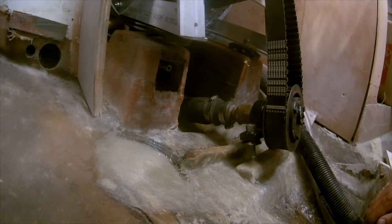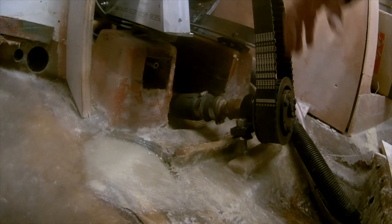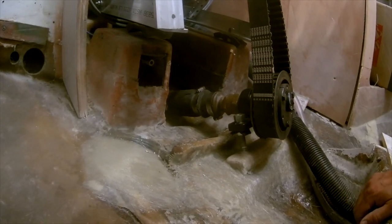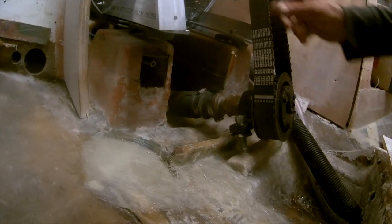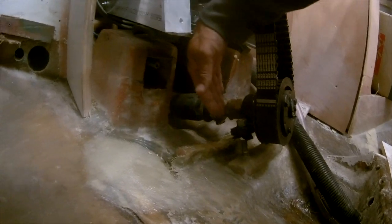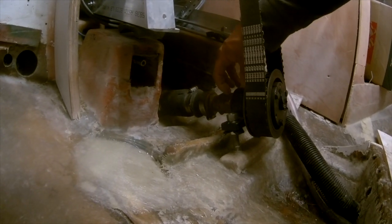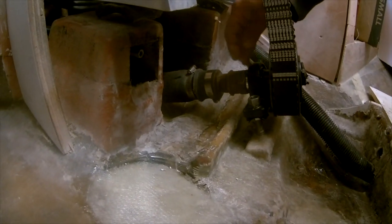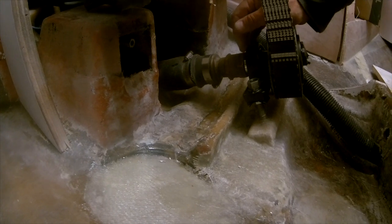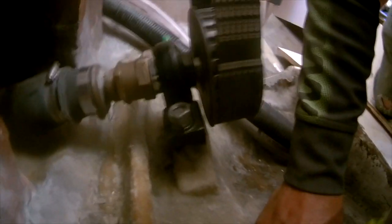With this second mount design, although the fiberglass on the bottom was quite strong — I put four or five layers, used the mat, and tucked it in every corner — you can see from the imagery that the bolts were actually leaning backwards, and that was really one of the failures in this design. The other thing was that I could only align the prop shaft up or down. I basically had to get it dead in the middle, and it turned out dead in the middle wasn't where I wanted the shaft to be. In the stuffing box alignment, there's basically a spot that needed to be just a little bit left of where I had it, which I couldn't do with this design.